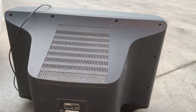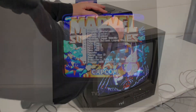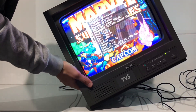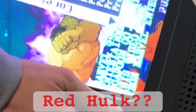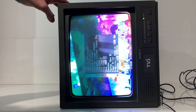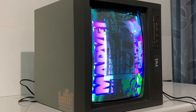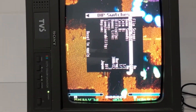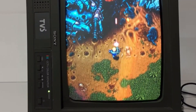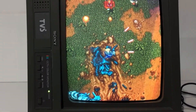Compared to the curved top of most consumer sets, I much prefer these cubes for stacking consoles on top, and the solid case makes them perfect for vertical gaming. You should avoid rotating a powered CRT because it can mess up purity and require a good degaussing to set it straight, but I'm just doing it here for the purpose of demonstration. Rotating left completely alters the colours regardless of whether it was rotated while off, so it looks like it's only suitable for clockwise rotation, which means I'll have to flip the screen in the arcade dipswitch settings on the MiSTer when I'm playing in tate mode.